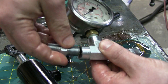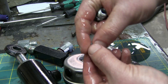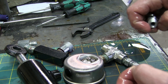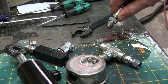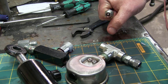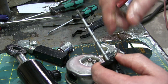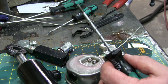Because we're going to be putting this into here, the check ball is free to move around. So we've got to cobble together a haywire spring. If you haven't got haywire, you're going to have to use a thick gauge copper wire and make a copper spring — not the best, but it'll get you out of a pickle until the proper parts arrive. We don't actually need this adapter; we're going to seat it right on the hose out of the grease gun. It fits just perfect in that bush. So what we need is a spring to keep that ball from flying out. This is also how you can make craptacular springs — not very stiff, mind, but enough to sort of get you out of a dilly of a pickle.